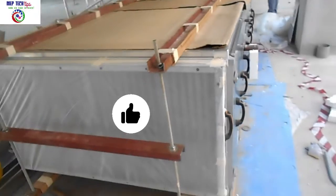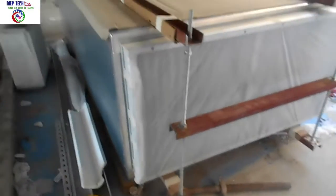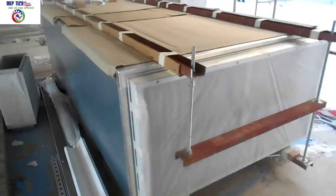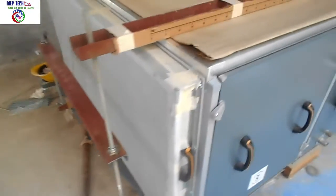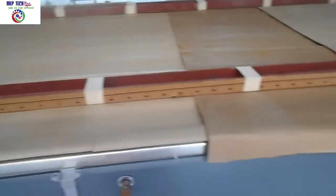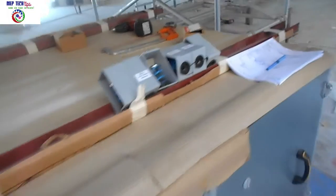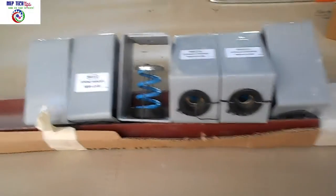For this hanging, we have prepared a C channel frame — as you can see in red color, top and bottom and the sides. With the help of the red dots we have made this frame. To lift the AHU, we will use a chain pulley, since for heavy weight items on the construction site we use chain pulleys. We have used three-inch C channel for the frame to lift the AHU.